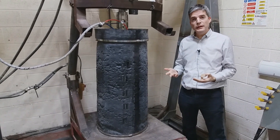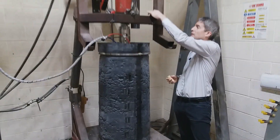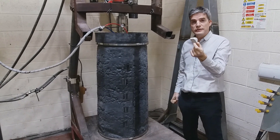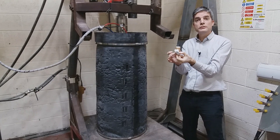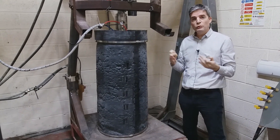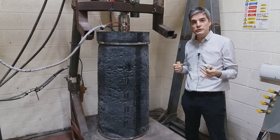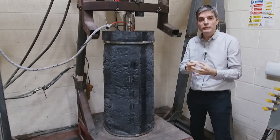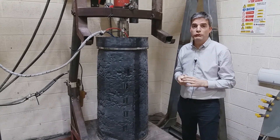So why is it that big? It's because of the particle sizes that we test. We test up to about 50 millimeter particle size, so clearly a specimen that small is not large enough — you get particle size effects. There are rules of thumb saying the diameter should be about 10 times the particle size, so if we test something with a 50 millimeter particle size, we need to go to 500 millimeter diameter.